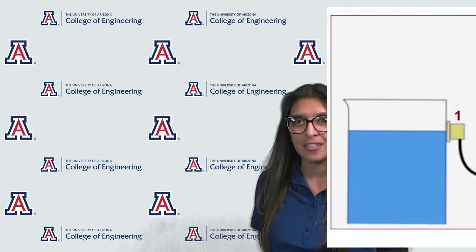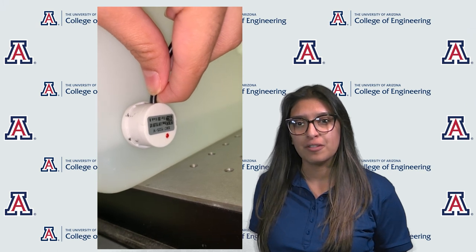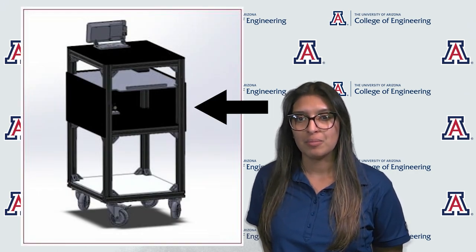In the early project stages, our team designed a capacitive sensor system to detect liquid levels. It was determined that this was not an accurate enough way to measure the liquid level due to the project constraints. The design concept we decided to provide our sponsors with quality results was a vision system. This design includes a camera which images the bottles and uses pixel analysis to determine liquid levels. Ambient light is controlled by a light-blocking mechanism built into the design so that we can control the environmental conditions.